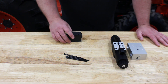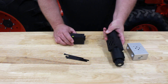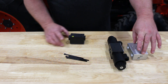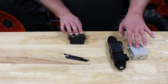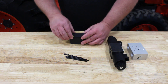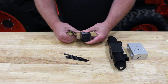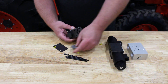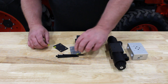This is the modular check valve. It's very similar to our third function valves and our rear remote valves. It's a two-piece valve that bolts onto the manifold. This modular check valve just goes in between the valve and the manifold itself. Just like our DO3 spool, this does have a protective cardboard. A lot of folks get this mixed up with a gasket, but we need to make sure to remove this piece of cardboard — it's just a protector on both sides of the modular check valve that protects the O-rings and the sealing surface to keep it from getting damaged during transport.